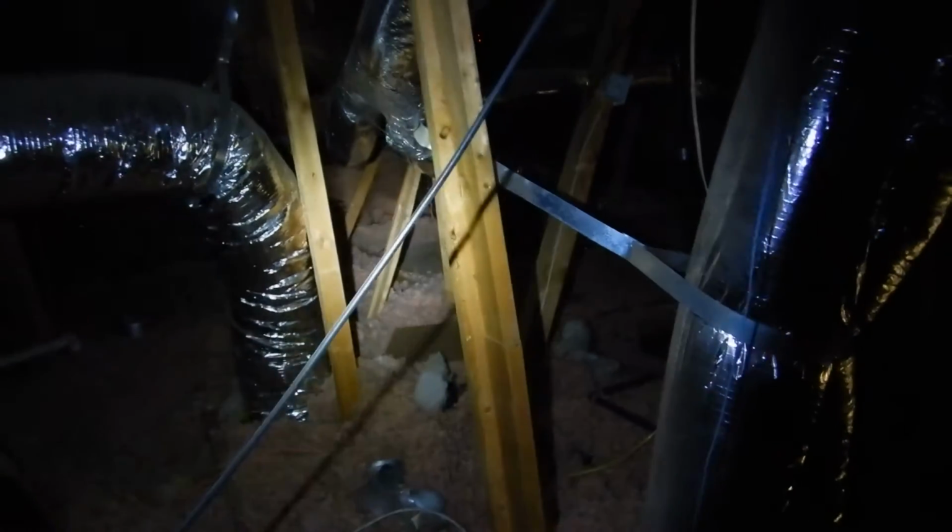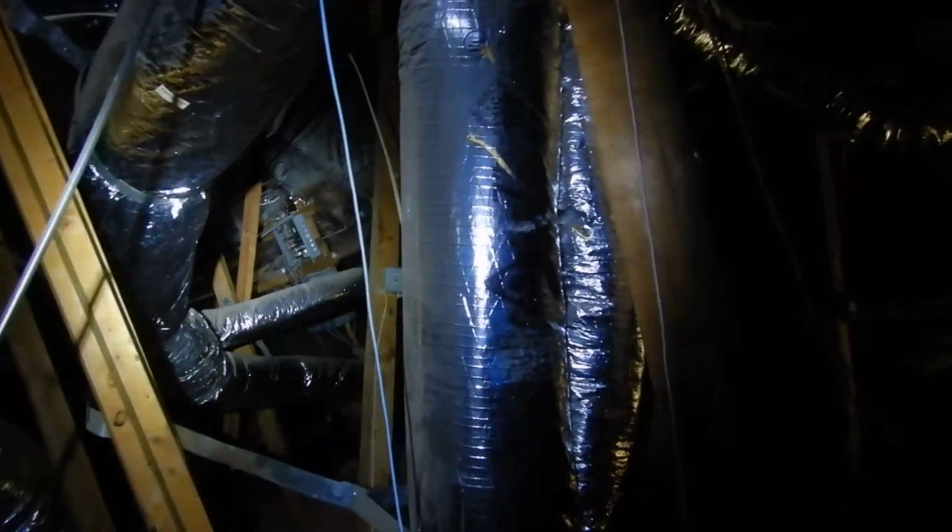And see these trails? See those trails in there? People didn't make those trails. That's the elevator equipment over there. And I'm already going to do something for the water heater. I'm already going to do something for the air conditioning. Elevators are beyond the scope of this inspection, but I will say this: you should have a 22-inch service platform to any mechanical equipment. We do not have the required service platform.